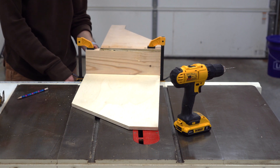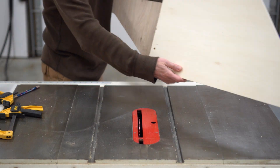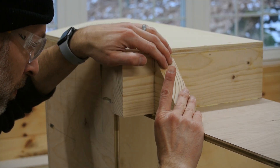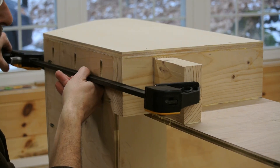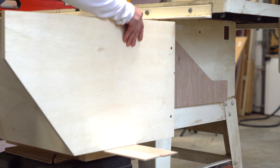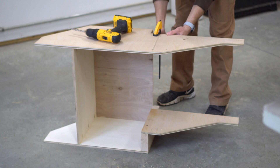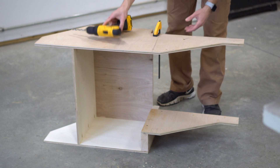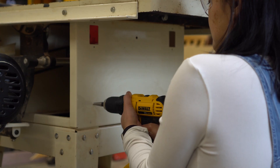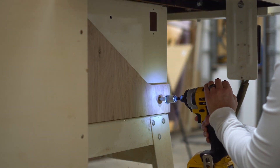The pocket screws make everything go together quickly, but I do have to take a pause and glue up the offset side. This is made up of two smaller plywood pieces that sandwich together the 2x6 that we ripped to size. I just add glue, clamp things together, and then pre-drill and drive in screws. They not only strengthen the joint, but also act as a clamp so we can keep moving with the assembly. A few more pocket screws hold the offset side in place, and then I can glue in the gusset that will provide even more strength and hold the parts 90 degrees to one another. Now we can test fit and start drilling the mounting holes. I start by drilling 1/16 inch pilot holes and then drill 3/8 inch bolt holes in the base. I make sure to clamp a scrap piece of wood to the bottom face to prevent blowout. Meanwhile, Chun Lu uses a stepped drill bit to work her way up to 3/8 inch holes in the table saw cabinet. Together, we attach the base to the cabinet using bolts, washers, and lock nuts.